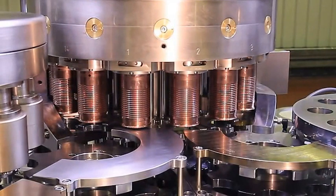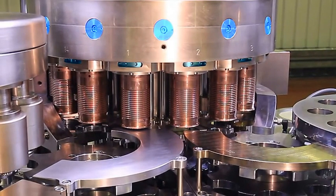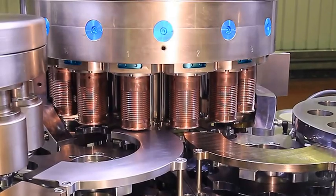The lifting device includes a strip-off plate to move the can reliably downwards. Furthermore, the depth of the bead can be finely adjusted separately on each beading tool by turning and clamping the eccentric bearing sleeve.